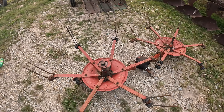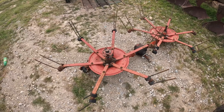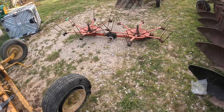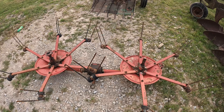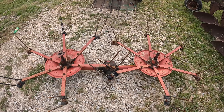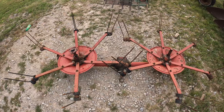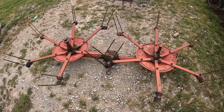Welcome back. I'm Rossi Oliver. This is a little New Holland — I don't even remember the number now, the tongue is a 163. The problem we have with it is it originally was a four-basket tedder and someone cut the wings off. The sad part about that is the machine now runs backwards. So in order to make this run the right way — if that's even going to be possible — step one is to totally disassemble it.